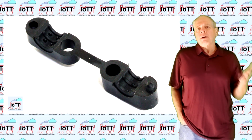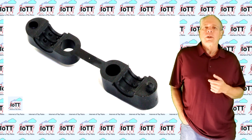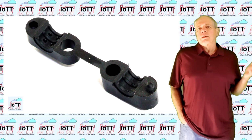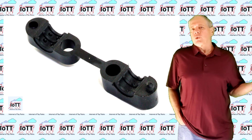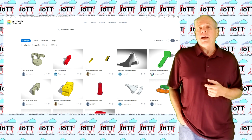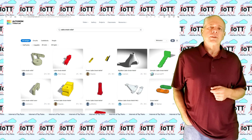If you lift up the power supply on the cable, all force should flow into the enclosure and none should reach the contact terminals, even if the force is a multiple of just the weight because you catch it in free fall. Some enclosures do have a built-in strain relief to make it easy. If yours does not, it is easy to make a 3D printed part to conduct the cable through and secure it with a cable tie.